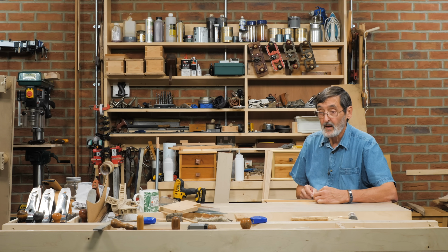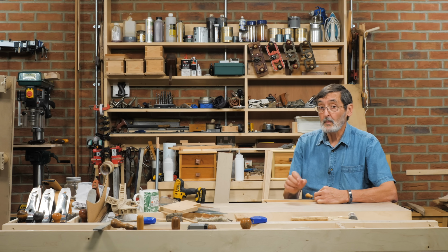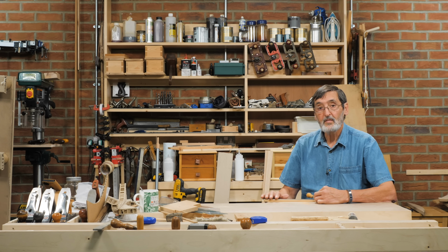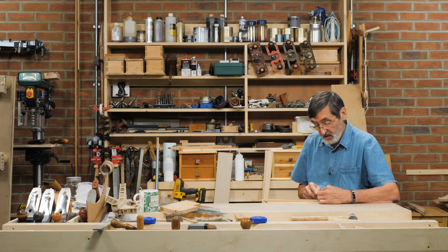We don't need any more than that, because when you buy an old saw, a second-hand saw, you're probably buying a lot of problems because usually they're not sharp, they're dull, they're rounded, the profile of the teeth has changed. When you buy a new saw, the teeth will be fine. They'll usually be set correctly, and the teeth will be punched out very evenly. But what we might have to do is sharpen the teeth when we buy it.